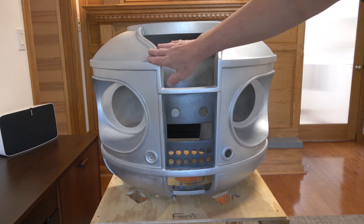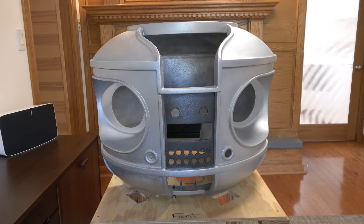I coated it with this base coat of silver — the shiny aluminum color I'm using for the base coat. I'm using it for two reasons: it's super fast drying, so you spray it on and it's dry in about a minute, and it has really heavy coverage per can so you're saving a lot of money. That's the aluminum ultra coat from Rust-Oleum. But that's not the final coat, because it doesn't look very good on a textured surface. The reason I'm using it is because it's so shiny — when you spray it on, it'll show you all the defects in the surface because light reflects off in all different directions, and you can tell which parts of the surface are rougher or smoother and which you need to work on before the final coat.